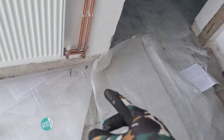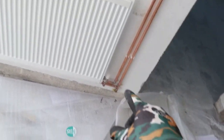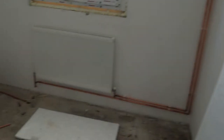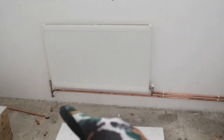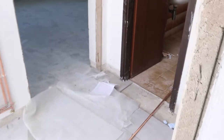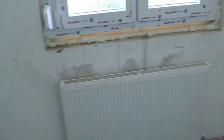I've soldered a few bits already. I'm working with copper because I'm most used to it, but you can use whatever you're comfortable with. The pipes just go down, and I put a drain-off valve on each one — just in case you ever need to drain off, it's always handy. I'm doing that in every room. You're going to have a problem if you don't have a drain-off and you get a leak, so that's ready on every drop.